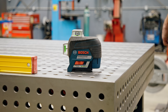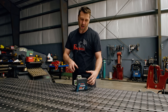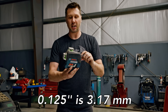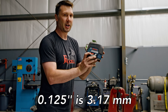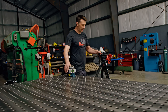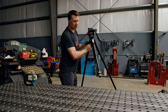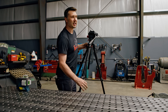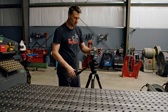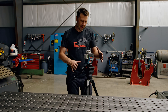The second way to level the table is with a laser. I've dimmed the lights so you can actually see the laser. This is an auto-leveling laser — it's probably accurate to an eighth of an inch, no more than that. What we want to do is set this up on the outside of the table, not on the table itself. I'm going to use a camera tripod, but you can use anything you have laying around. I want it to be as close to the table as possible because the laser line gets wider the further away you get and we lose accuracy.